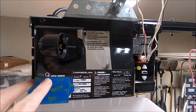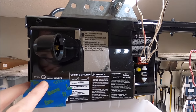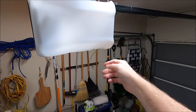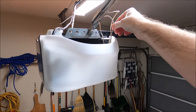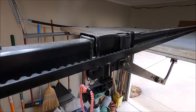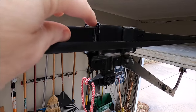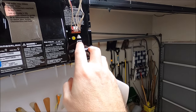In this video I'm going to show you how to adjust the door opening and closing on this Chamberlain MyQ garage door opener. Your controls will be on the same side with the antenna or where the wires come in — just take the top and pull it down. I've removed the bulb so you're not blinded. With the garage door open where I want it, I made a mark right here by the trolley so I can see where I want it to stop.